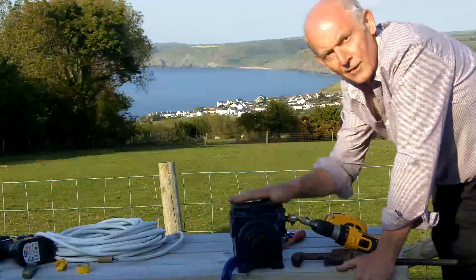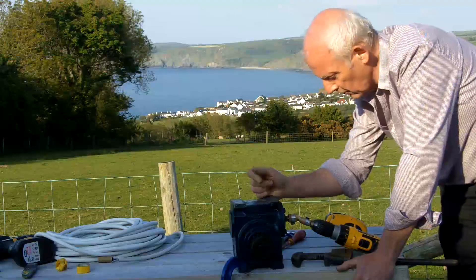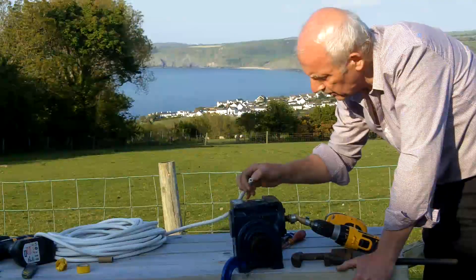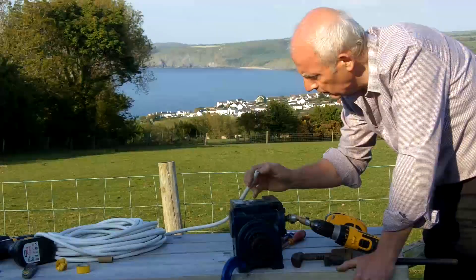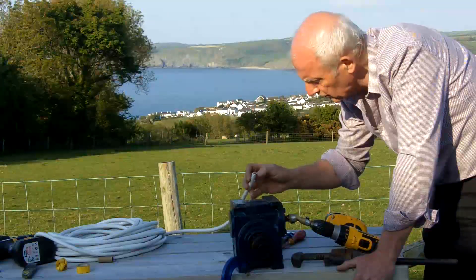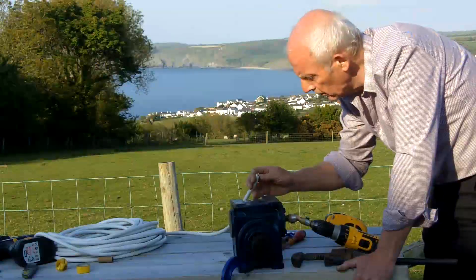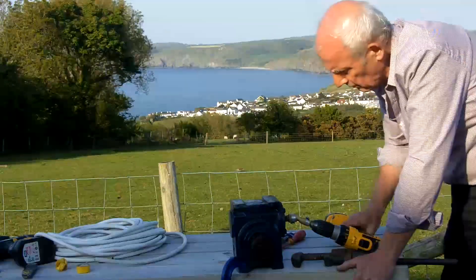It's not a done deal yet but I just wanted to share where I'm going. I bought some 2.5 millimeter square cable — that's the cross-sectional area; it's 2.5mm² total cross-sectional area for each of the five cores. I don't know what current I'm going to be pulling, but the only other cable they had in stock in the local town was 1mm square, and that wouldn't have been clever enough.